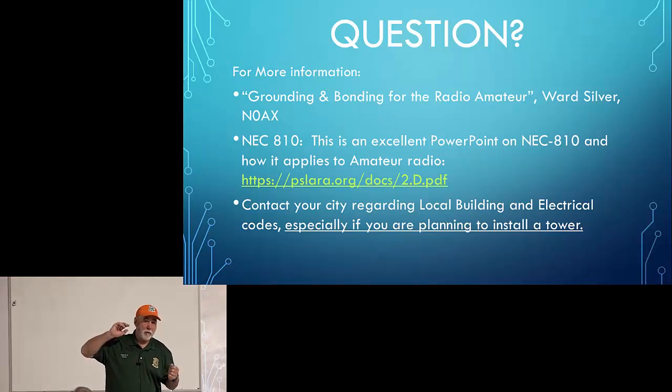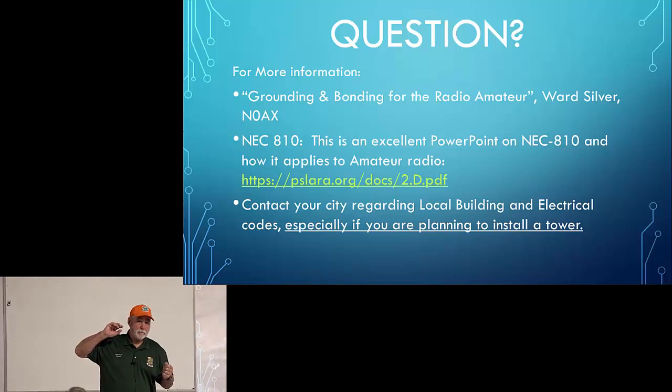What's that? I thought it was the other way around between the balun and the UNUN. No, the UNUN, like I said, in all my discussions with Palomar, and the one discussion I had with Balun Designs, their UNUNs do not provide choking. But a lot of their baluns do. What about your UNUNs? My UNUNs do not provide any choking, and I always recommend a choke be used with the UNUN. Larry, before I go to you, I think Alan had a question.